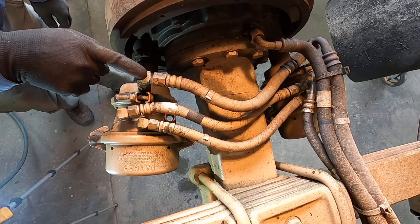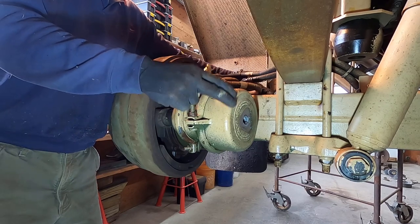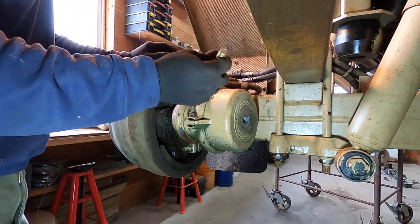This port is just an air vent. We have no air pressure so we cannot budge the brakes. The large springs in the emergency end of the canister are applying the brakes. That's why we need to cage them.